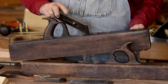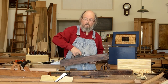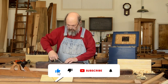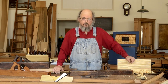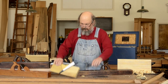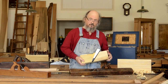The top part of a double iron is called the cap iron. This changes how the inside of the mouth and the throat of the plane is manufactured. We're focusing on 18th century style planes, and I have made a model of the throat here — a cross section — that will help us understand some of the features of the inside of the plane.